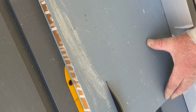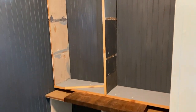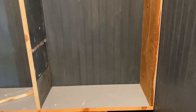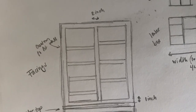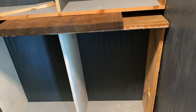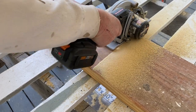After ripping down the boards to make the narrower upper shelves, we went ahead and placed those in the space to get a sense of how everything was going to work together. We realized that the wood shelves are not going to be wide enough to go fully in between, so we're going to pull the outer piece in a little bit and make up the difference with a wider facing. At the bottom, we'll match the width of that facing but keep the outer piece pushed all the way out to maximize storage. With the plan in place, we cut the chunky upper wood shelves to length so I could start sanding and prepping them for stain.